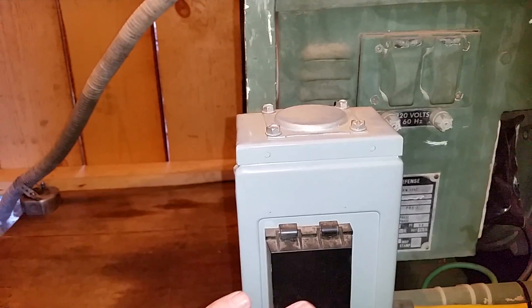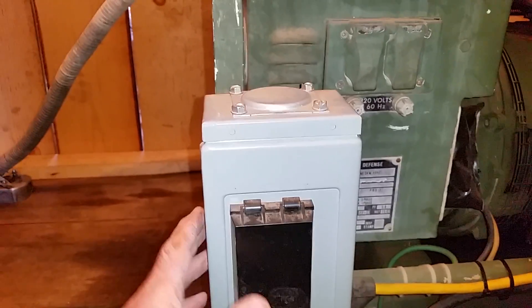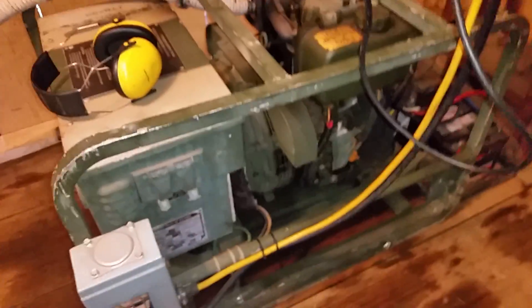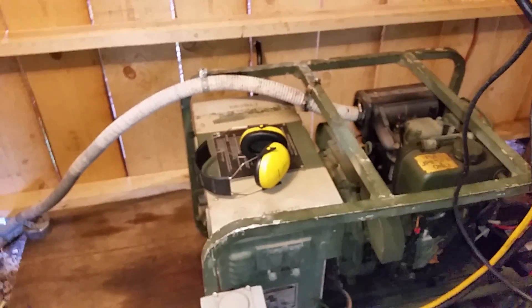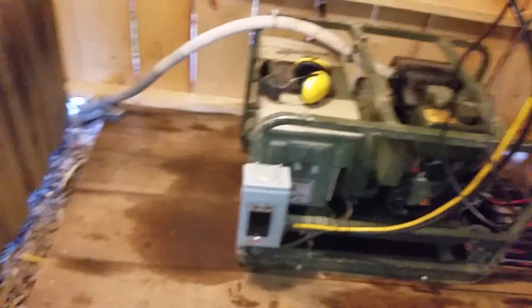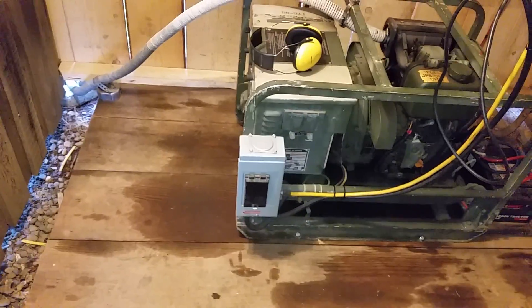So when I put the piece of styrofoam back, I checked every connection, every junction box, every wire, everywhere, and everything was perfect. I went back to here, stopped that breaker from vibrating, and the inverter liked the power. So what I need to do is take this junction box off of this frame and mount it on the wall like it should be. I probably have some seal-tight up there, but I need to mount this junction box remotely because the vibration is just going to tear that breaker up.